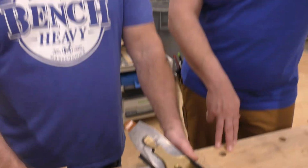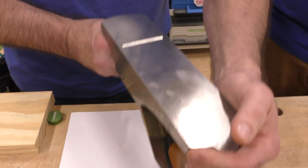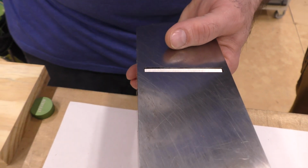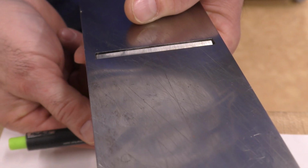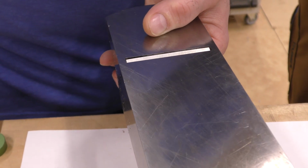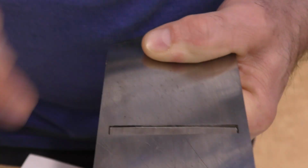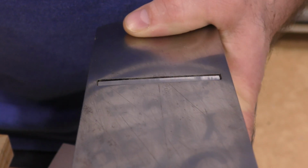So you're going to notice why I've been doing everything on a white backdrop. It's because I like to take it, and Chris, hopefully we can get that. Okay, I'm going to feel it. That's perfect. But what I do is I'm just going to grab this so we can see it. I'm looking here and here, and that white backdrop is good. I've seen people put a little pen light down here or whatever, but that looks parallel to me. I let the blade talk as I set it. Now the other thing I want to show you is, as I take that lateral adjuster, look, you see it start to cant? So that will dig in more on the other side, because I know it's not parallel. I've always taught you, your eye really doesn't lie. So I'm just going to bring that in like that, and that looks good to me.